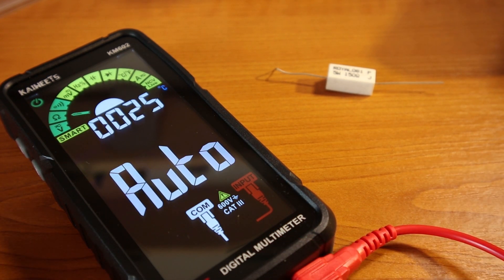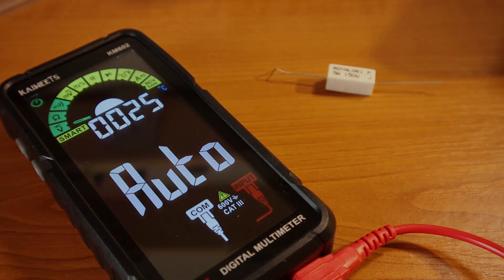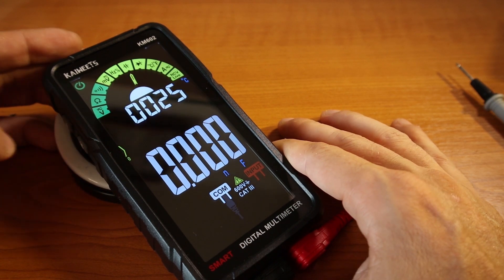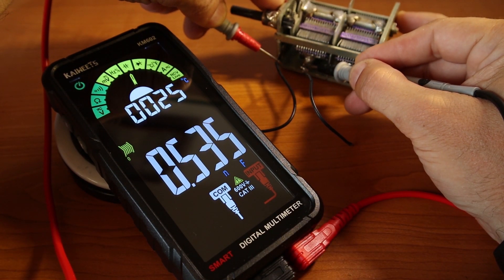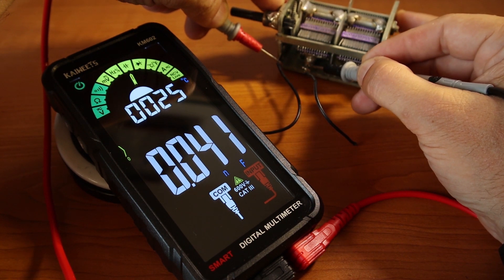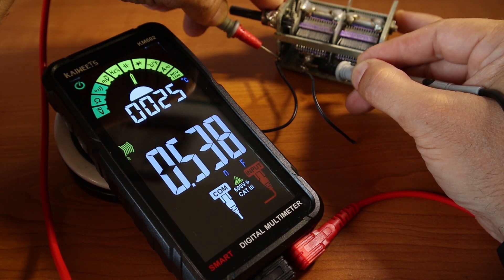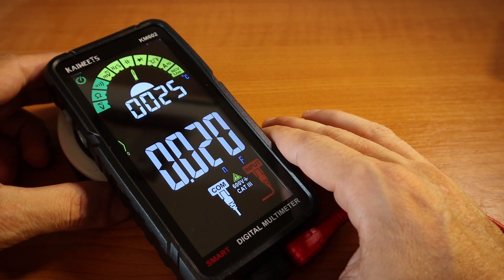I love this — I find it very useful when I'm moving quickly. So now using the functions button on the side, we'll move to capacitance. I'm taking one of my variable capacitors to measure its value. It detected 0.5138 nanofarads, which means 513.8 picofarads. That's actually the value I usually measure with my other meters — about 539 picofarads. Really great.